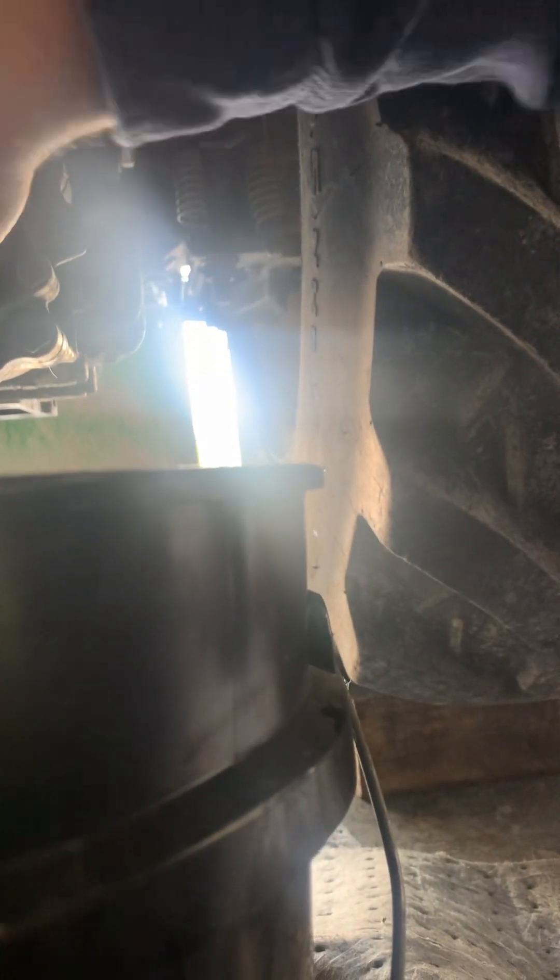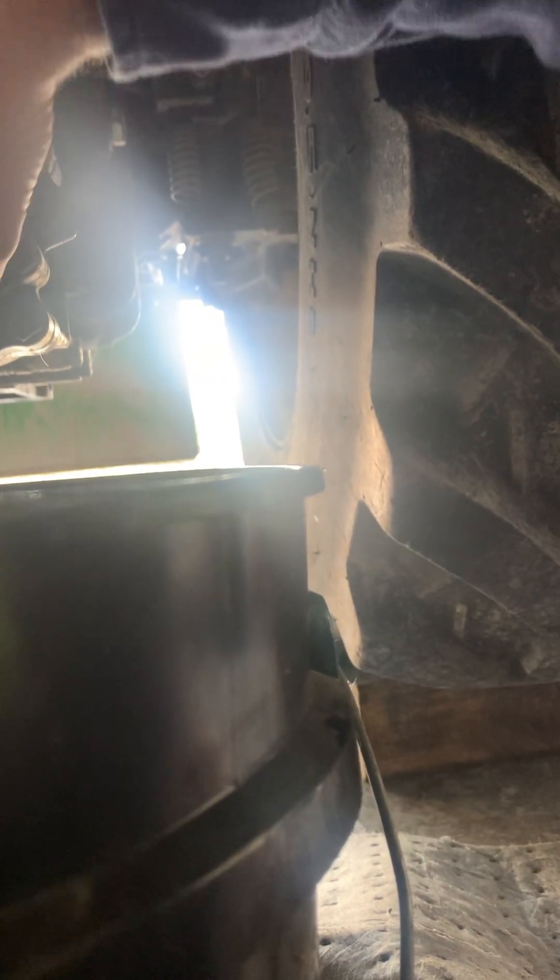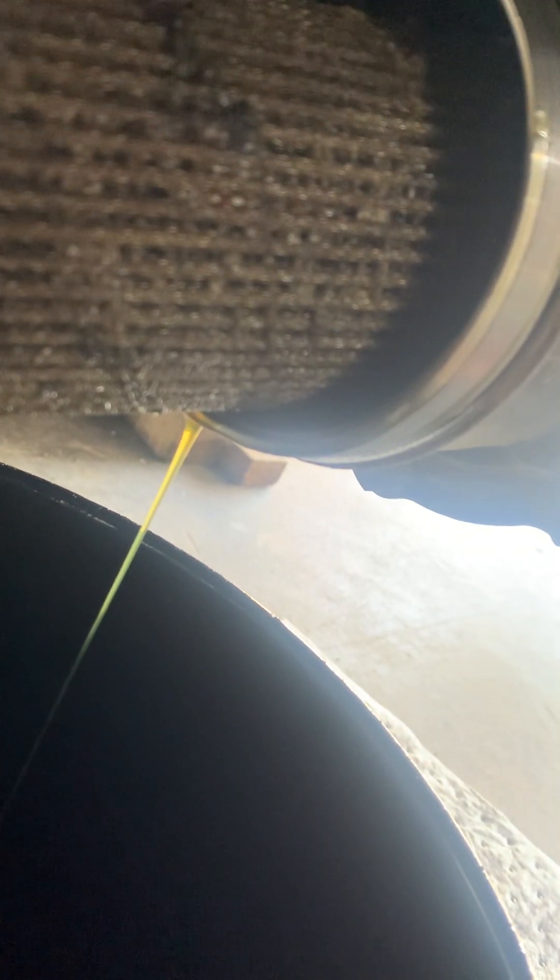I had to drain the hydraulic fluid — there's about seven gallons I drained out of this thing. I don't know how much is going to be in here. Good — not much. You see, that's just a cap, and then there's a cartridge. There it goes, just pop the cartridge right out. It's gross. I find that satisfying when you get the filter out and it's filthy. Downright filthy.